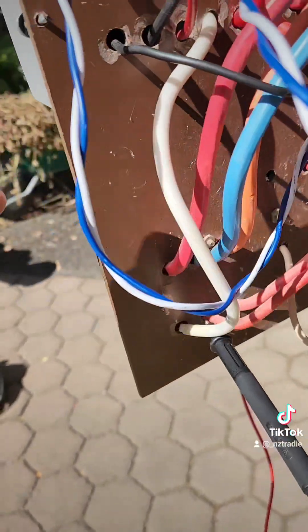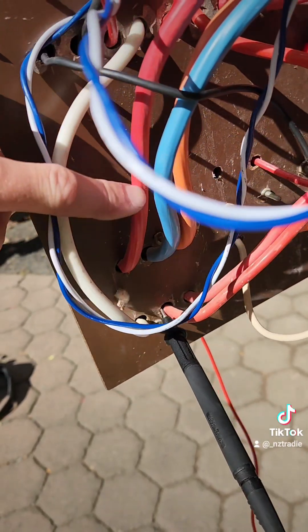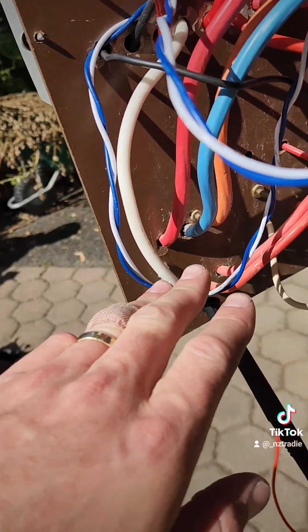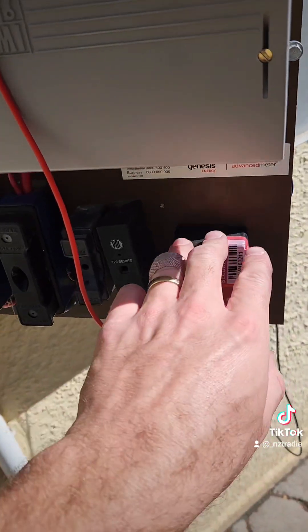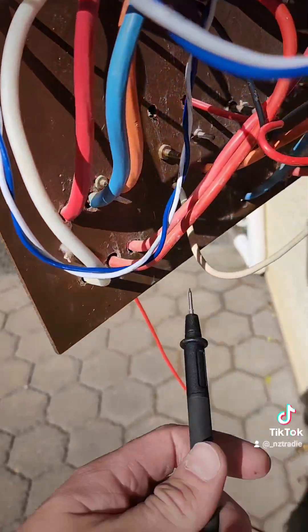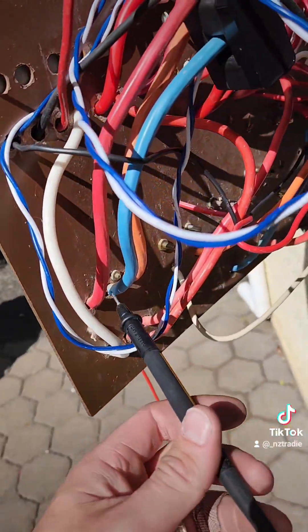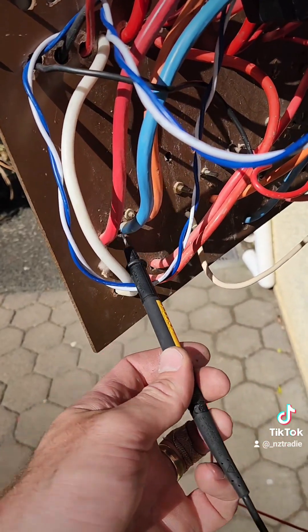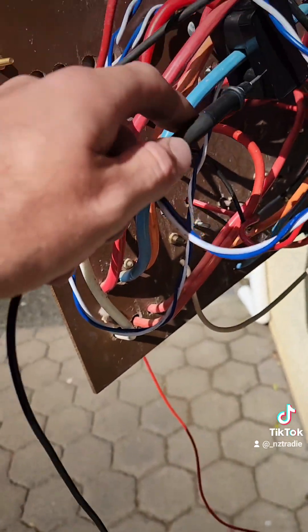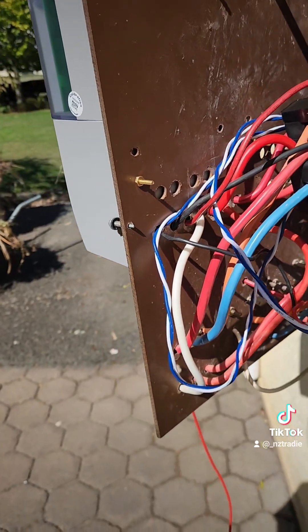Here's the reason this kind of thing gets so confused. You would think, in New Zealand at least, red's first phase — then it's blue and orange, so it's a little bit confusing — but you'd think it'd go 1, 2, 3, which is how they've put it in the board this way. But then if you come here, it's actually red, blue, orange, so it's opposite. They would have fitted off from the other side of the board to come around here, and it's different. Then, to make it a bit more complicated, it all goes to reds, or a white, into different fuses, or into the meter and then to fuses. So that makes the whole situation get confusing quick. I've just tested here with the polarity to the Envoy, and we've got phase 1, phase 2, and phase 3, which is what lines up with everything else, and I've put the CTs on in accordance to that. They should be all sussed now, and their solar will show its production and consumption correctly.